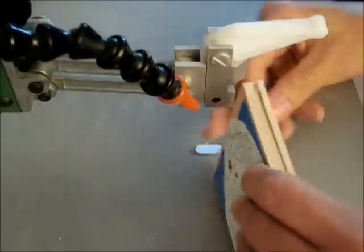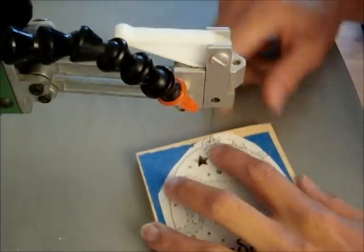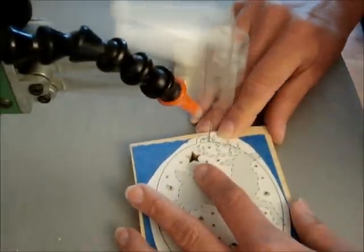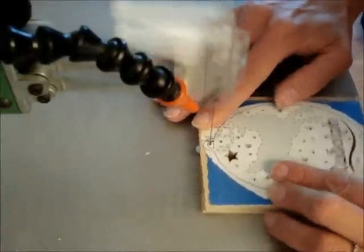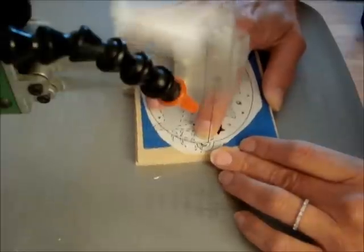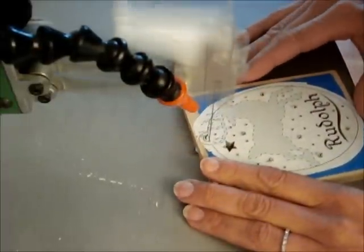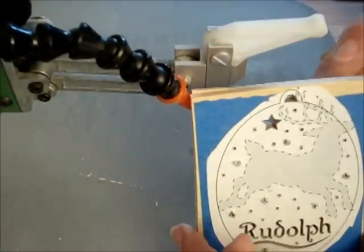And now finally the little hanger. This is a good place to practice because usually there's ribbon or something through there and you don't see it anyway. We'll do this like our normal cutting — I want nice sharp corners. So I'm going to come right before the corner and turn into it. Then it'll fall out. I'll do the straighter edge first, bring it right to the point where I want it to stop and go back, then come around. And that's a nice, clean, sharp corner. And our plaque is done.